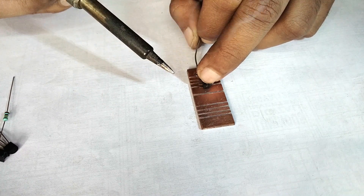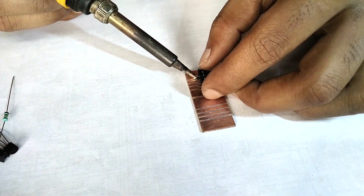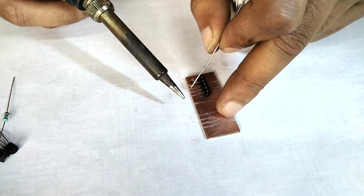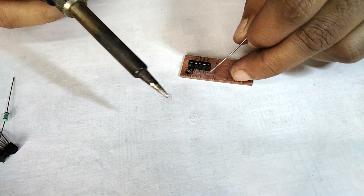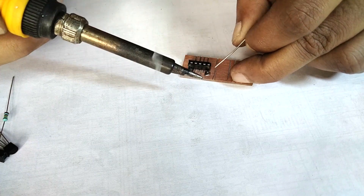The circuit itself is a high gain amplifier with negative feedback. It flashes an LED when two good NPN and PNP transistors are connected in the right way. I am following the copper clad dead bug style construction as shown in the original article. For the connectors I used a split up IC socket.